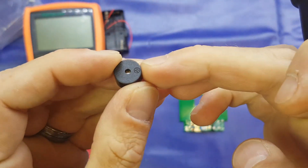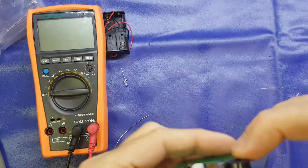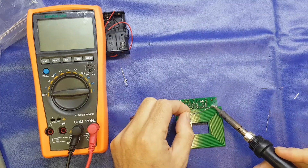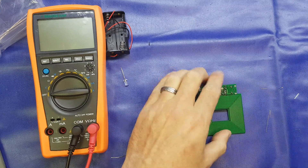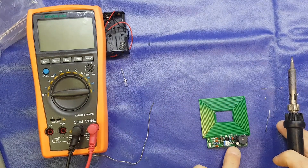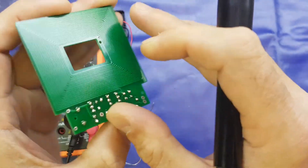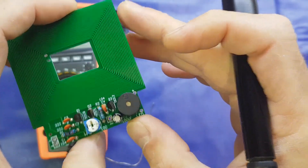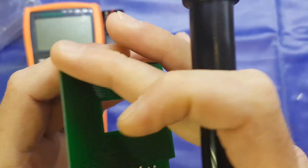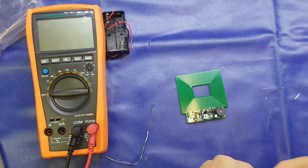And the speaker — yes, it has a small positive indication on there, clearly marked on the silkscreen as well. There's also a small negative symbol just to the left of the capacitor connected to the negative rail. I'm not sure what that connection point is for — we'll have a look at the circuit diagram in just a moment. The longer lead is the anode, the positive side, and the shorter lead is the cathode, the negative side. Pop that in and gently manoeuvre it into place.